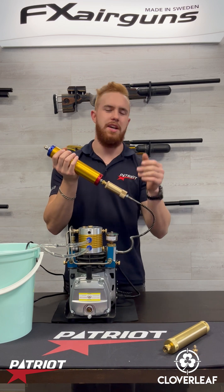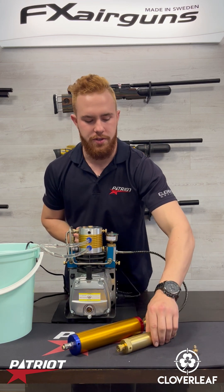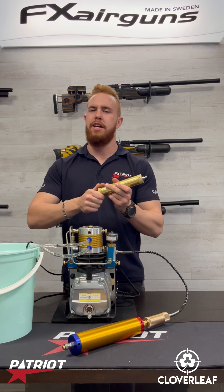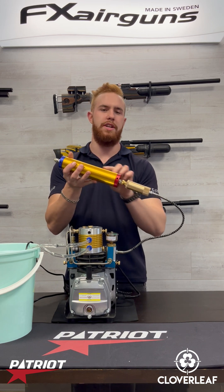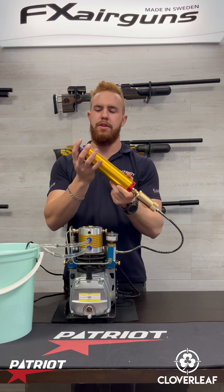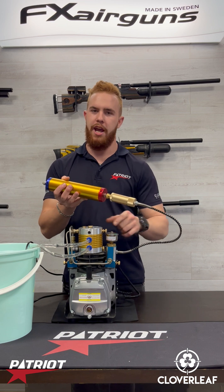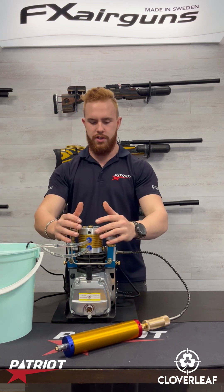When we sell one of these compressors, the included filter may work, but every second or third fill you'll need to replace it, which becomes a pain. What's nice about these two larger filters: one has a much larger filter on the inside which is easy to replace — I'd say every 10 or 12 fills, or just keep opening it up and checking. If you've got some discoloration, swap it out. The other bigger chunky one doesn't have a filter inside but has a tubing with carbon shrouds and carbon balls, which work a lot better. Once you have it set up, leave it. Please don't swap it around — if you charge a few times, water builds up, and swapping it will push air back into the system.